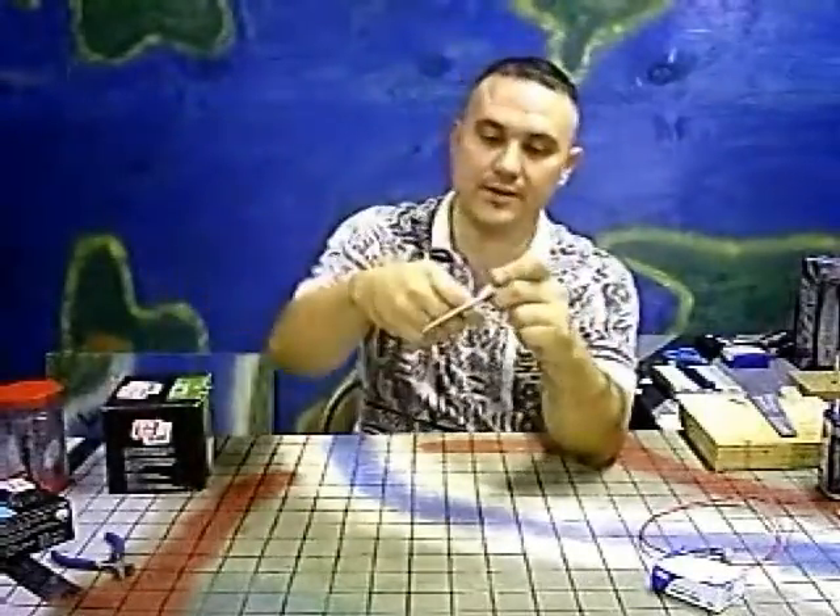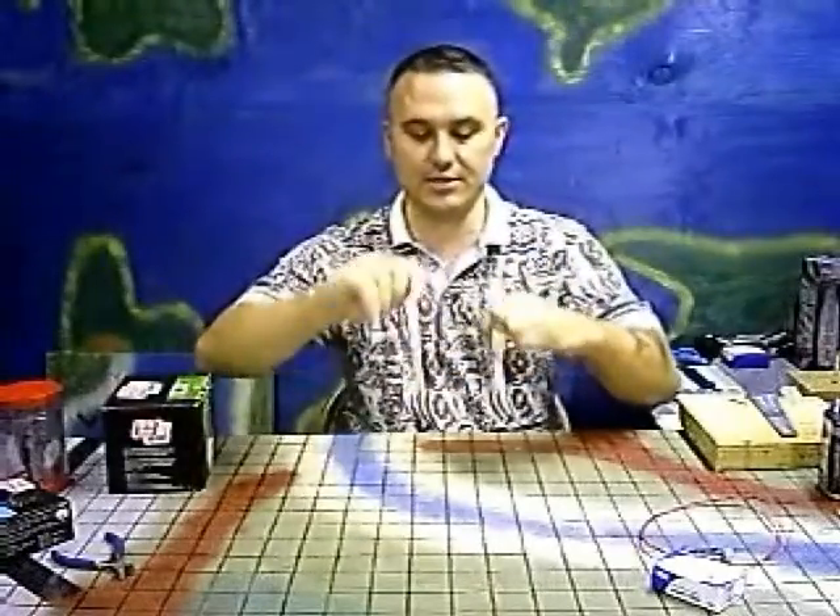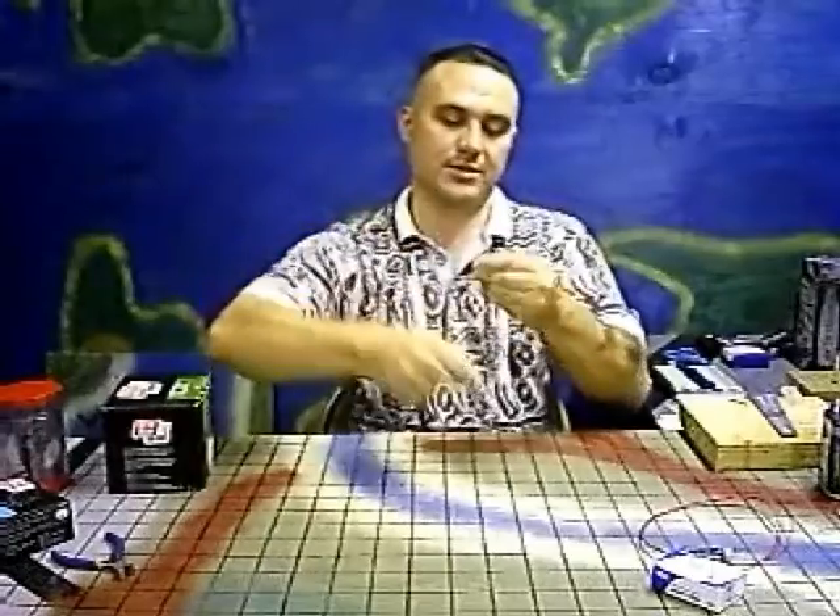The nail is a ferrous material, which means it's attractive to magnets, and I'm going to try to create an electromagnet by winding my wire around it. This is approximately six feet of solid wire. I like to use solid wire — you can use stranded, but the solid is going to stay in place and not try to unwind on you from the nail. You can be neat with this, but just for time's sake I'm just going to wind it on around.